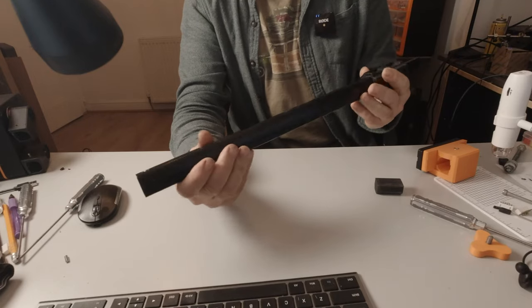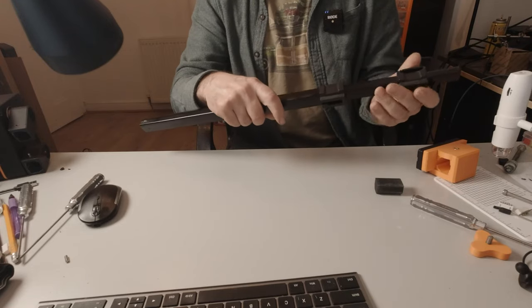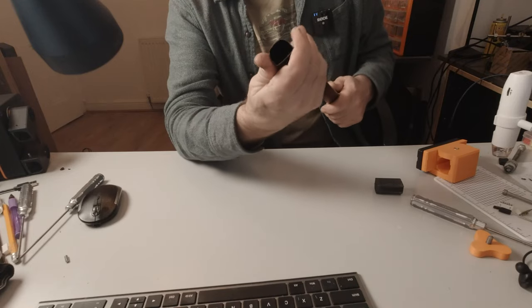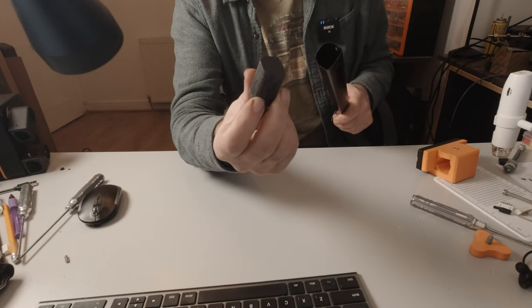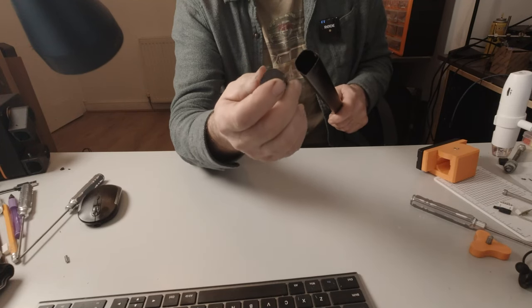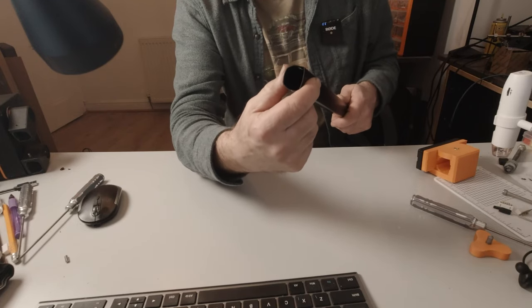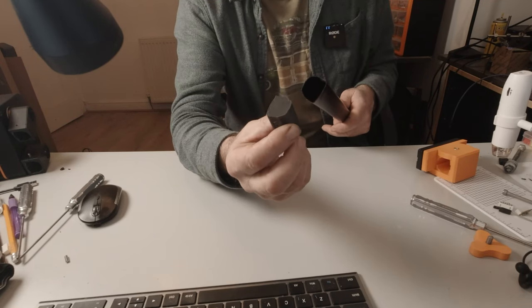Once you've got your two jib arms, open them up a little so the sections are away from the ends. The open end of the tube would easily crush if left like that, so print off these two blocks — part number 3103160 — which are the same profile as the aluminium section. This prevents the aluminium from crushing because it's pretty thin in section at the end where it goes into the bearing seat. Slide these blocks in flush.